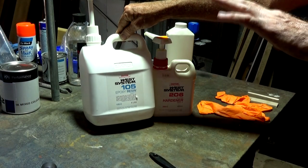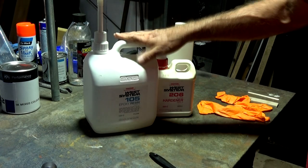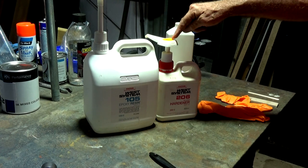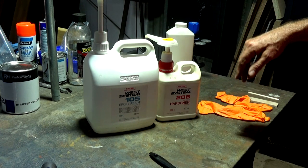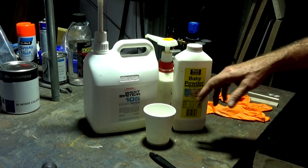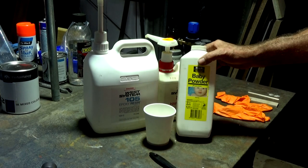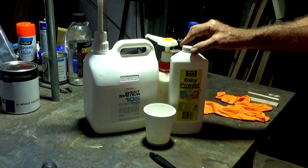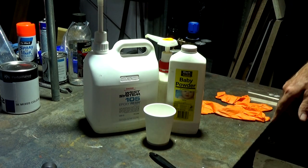This is what I'll be using to laminate together these two handrail sections. I've used this stuff before — it's great, it's expensive: $120 for a 4-litre pump pack. But a little bit goes a long way. These have integrated measuring pumps, and this one does a 5-to-1 mix ratio, so one pump of resin and one pump of hardener gives you the correct ratio. I've mixed some together in a cup and we're going to add some talc because that's going to bulk out the resin and increase its viscosity, so I can paint it on and it's not just going to run down the sides of the timber. You can buy specialist fillers for epoxy resin — microspheres, microbeads and so on — but essentially they do the same job. They just bulk out the resin.